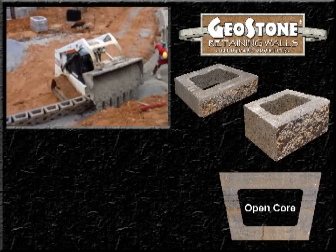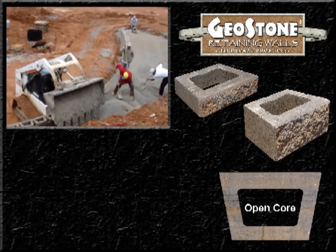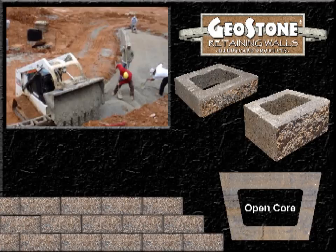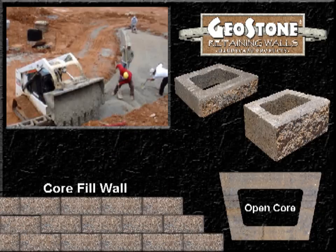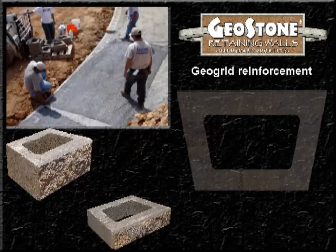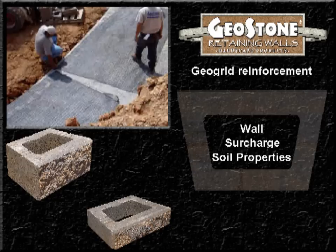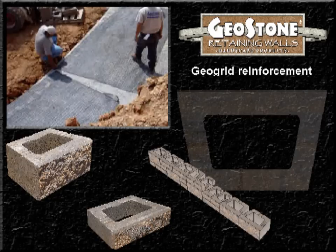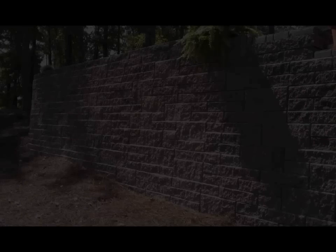The area behind the wall must be filled with this material as the wall is constructed. It is not recommended to go more than three or four courses high without core filling the blocks, as this can leave voids and possibly compromise connection strength. Geo grid reinforcement is still placed as recommended based on wall height, surcharge, and soil properties. The grids may need to be cut to accommodate the different courses and their varying heights.